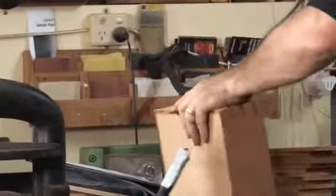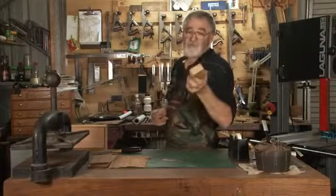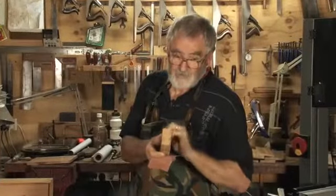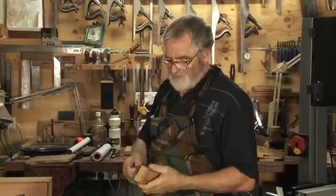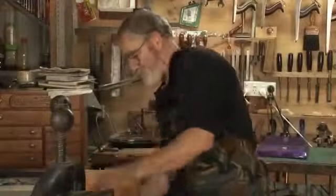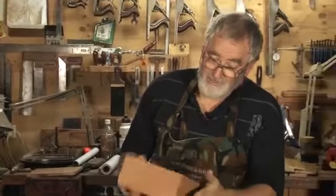And then it's just a simple question of popping it in the vise, sanding block. By the way, with a sanding block, it's a great idea to get a bit of plywood and glue it actually onto the cork. Cut 12 mil off, a 12 mil bit of plywood, then you've got a nice flat surface. And we'll just sand it. There it is, finished. And you can hardly see those keys.